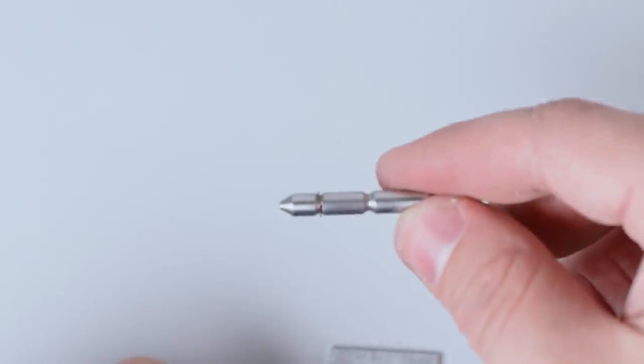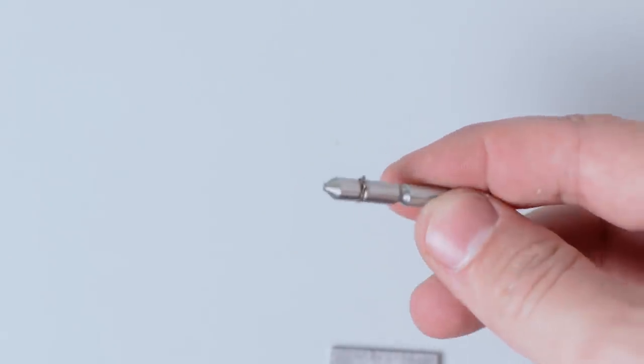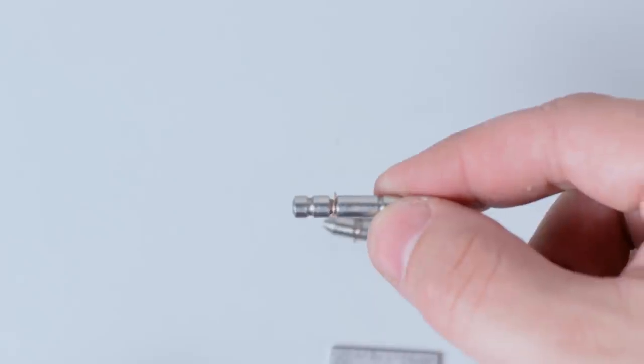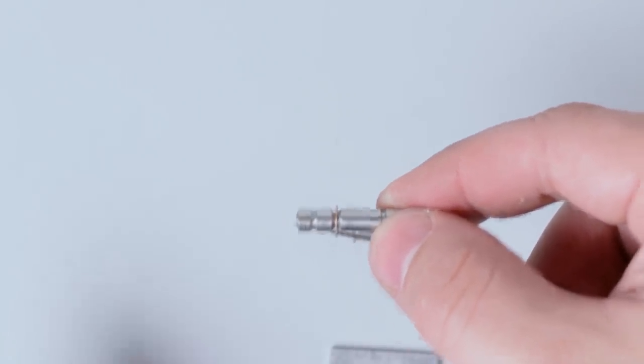But I didn't have to make an entire perfect Balisong mechanism and machine all the parts and stuff to test this. And it's good I didn't, because the first time I tried it, I had way too steep of angles on the grooves, and so it didn't work.